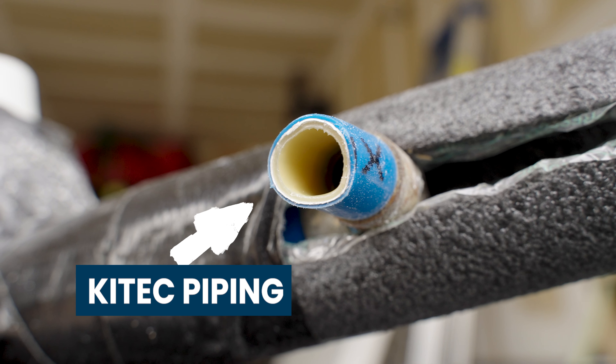This is the incoming water pipe, which will feed into the water softener, and then from the softener it shoots through here. We make this a bypass. Today we're not hooking the softener back up since a different company installed it and they don't want us touching it for warranty reasons, which we understand. Once the water is on, we'll keep the bypass open and these shut, so water bypasses the softener — coming in through here and out to the house. I'm also going to label the valves for the plumbers that come behind us to hook the softener back up, so they don't have to do any guessing as to where water is flowing.